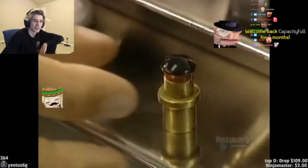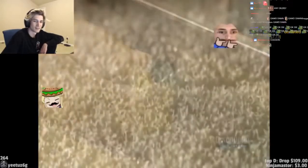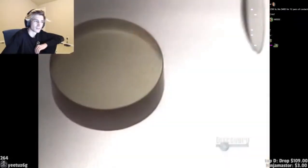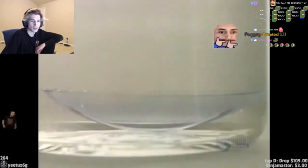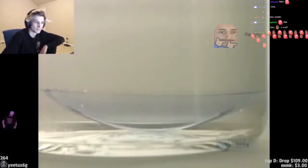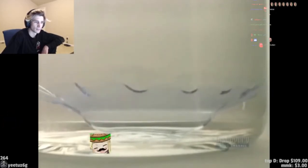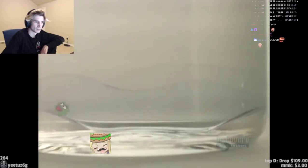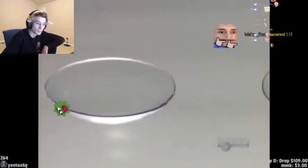With everything computerized, the quality is incomparable. A technician then polishes the rims of the lens. The polymer is then hydrated to make it flexible. Lenses remain immersed in a balanced pH saline solution for 24 hours. The lens becomes engorged with liquid and expands, reaching the desired proportions.